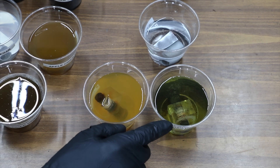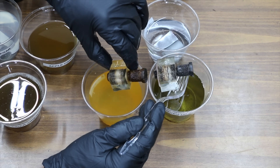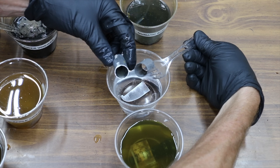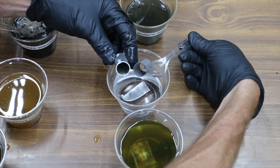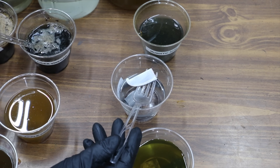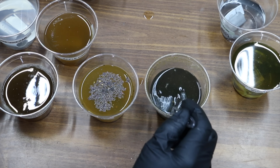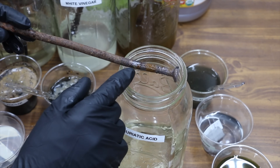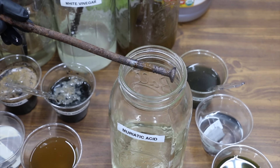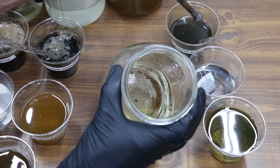Water's on the left and the muriatic acid is on the right. Look at the difference — very little rust left on the muriatic acid bolt. The aluminum exposed to muriatic acid is just about totally dissolved — it is very thin. There doesn't appear to be any damage to the painted surface yet, though there is some metallic color on top, which I believe is the aluminum. Most of the metal flakes inside the container with muriatic acid have been dissolved. The muriatic acid has cleaned all the way down to bare metal in one area, and the rest of this rust is quickly being removed. This muriatic acid is attacking the rust with a fury.